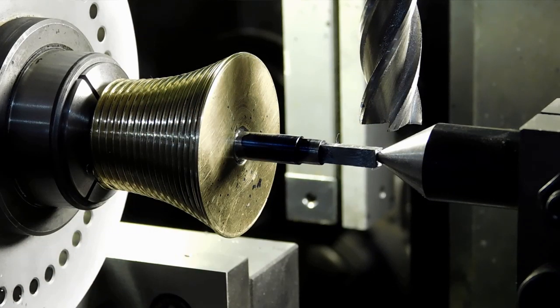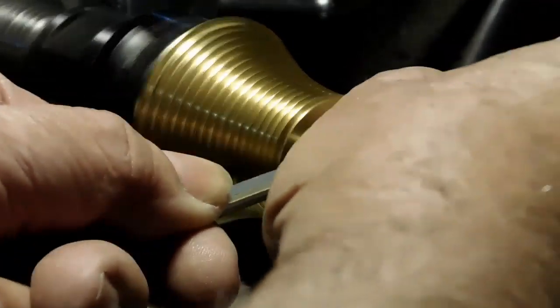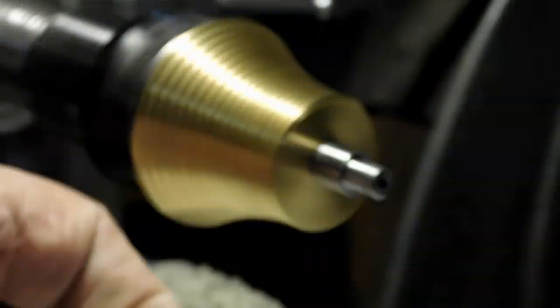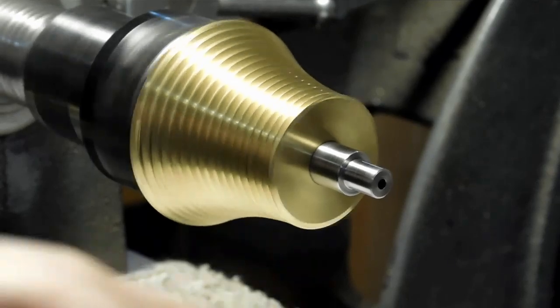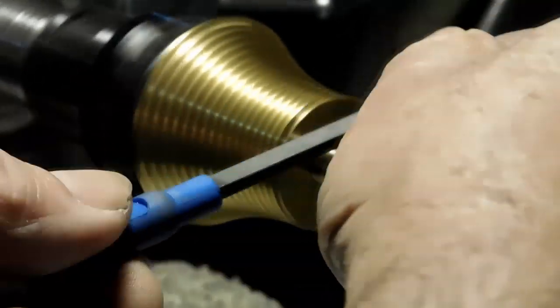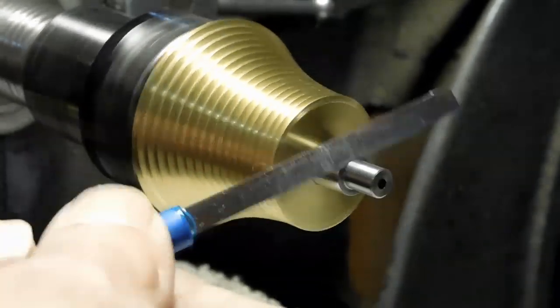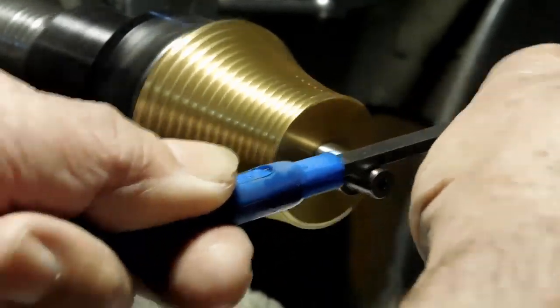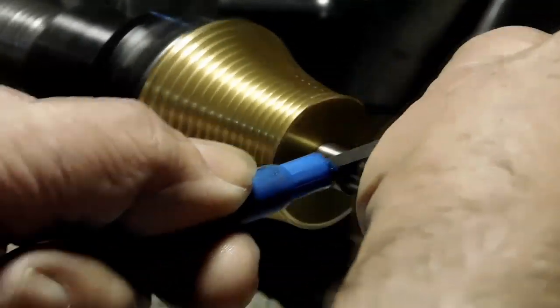Here's the setup for squaring off the end of the arbor to make it wind. I didn't show making the pivots, but now I'm getting the pivots all polished up with these styrofoam-backed sandpapers I like so much. That puts a nice finish on the pivot, but we're going to burnish them too. This is a pivot file — a very, very fine file that gets into the corners. We bring it up to a nice high polish, then add a little oil, and now we're burnishing. This hardens it up and gets it ready for the next phase.